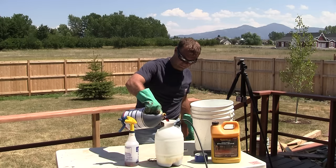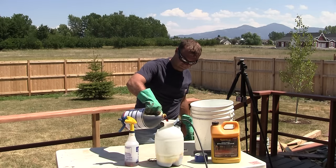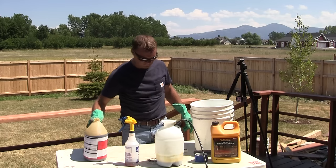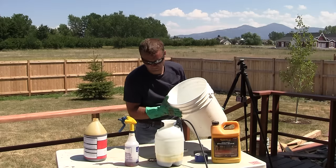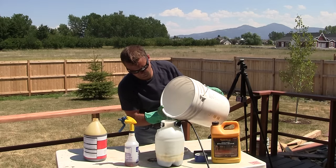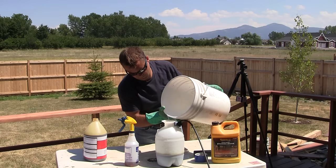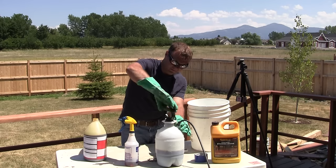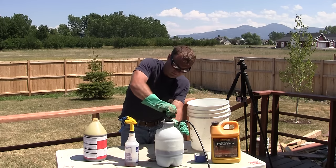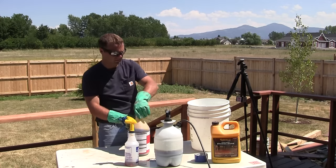Make sure you are wearing your protective gear whenever dealing with the stain. I'm using a dark walnut stain and diluting it with water about one part stain to about two parts water. I like to dilute the stain so I can get the correct shade — if the first coat isn't dark enough I can always do a second coat, but if it's not diluted it can go on darker than you want and you won't be able to lighten it up. That's why I recommend diluting and then doing multiple coats if needed.